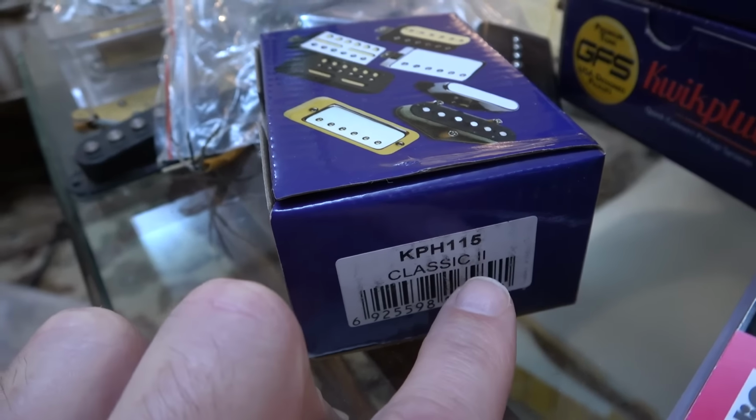And let's go ahead and populate this pick guard, and then we'll begin the process of wiring it. Need some springs for the pickups, and I think these two right here will work. The only screws that I could find easily for these pickups were kind of large though. Yeah, I think that's all I've got that's gonna work. And if I want to, I can come back later, and I probably should go ahead and countersink those holes, like these holes, and sink those screws down a little bit. Looks like these are about 7/32.